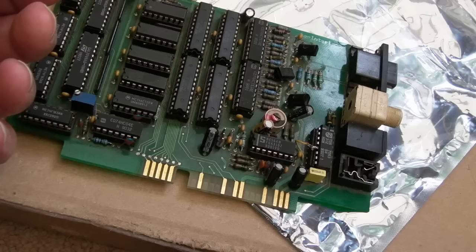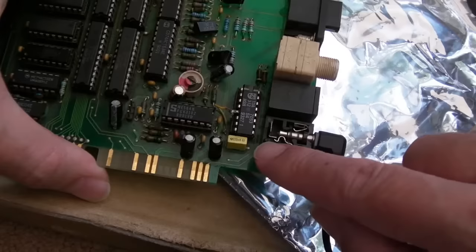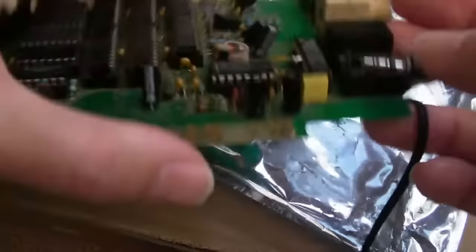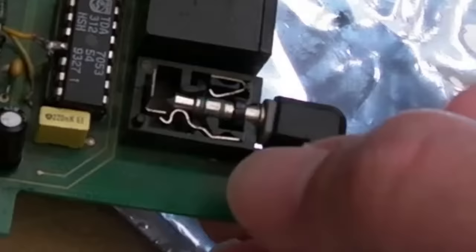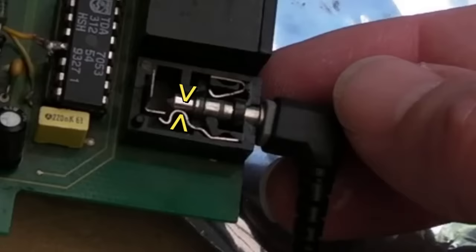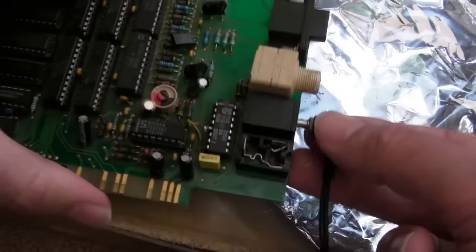Before going on a wild goose chase, let's just try something. I've got a headphone jack here — some earphones. Yeah, that's what it is. You can see the switched contact on the end. Looking on the inside, I've got three contacts — the switched one doesn't seem to be doing anything. It's literally just the outer ones. The top contact goes to the middle, so it's the end and the middle — and that obviously disconnects. So that's exactly what that is.